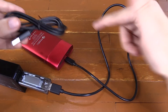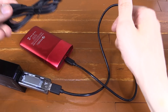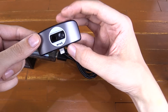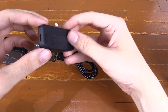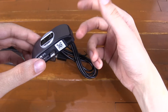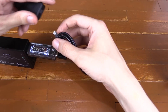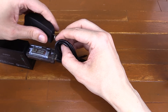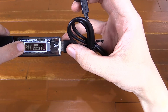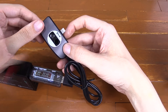So right away we know that this cable is better than the other one, and we might want to get rid of the inferior one. Another use case is testing the maximum input of a device that doesn't have publicly known specifications. Most phones will state a maximum of 1 or 2 amps, but some devices don't tell you. For example, this is a FLIR-1 thermal camera — you can see it's at 5 volts and around half an amp, so we know it charges at roughly 0.5 amps.